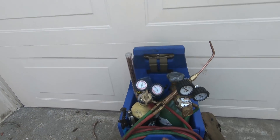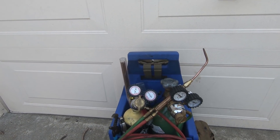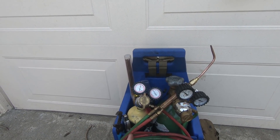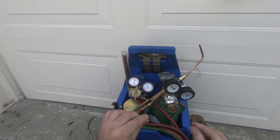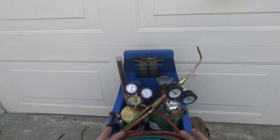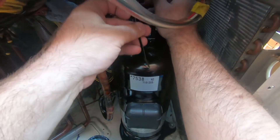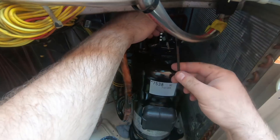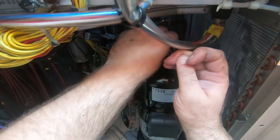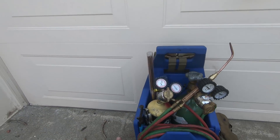Now why do I keep tie wraps in different sizes? Well, I use them a lot of times when I'm brazing things like compressors and you have a discharge line or suction line that just wants to keep popping out on you. You'd be amazed how useful a couple zip ties can be — put together as long as you need to cinch your pipe to a certain area and keep it snug while you braze. As you can see right here, I'm doing a Daikin compressor and the discharge line 90'd up and over. So I was actually able to feed tie wraps through the little eyelet hole at the top of the compressor and that discharge line and keep it tight while I brazed it.